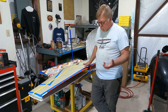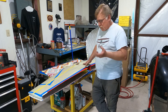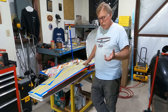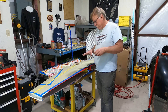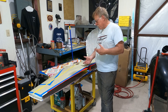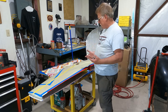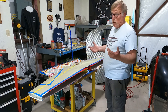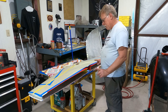If you only had one cracked spar, you're kind of screwed - you're going to have to take out the whole assembly and replace a spar. But in for a penny, in for a pound. If your spar is in perfect shape, just do that repair. But this aircraft has been ringing around with fatigue - it's obviously got some fatigue issues with the cracking going on. So we're putting two brand new spars in. The owner will feel a whole lot better when he's doing all those wonderful aerobatic maneuvers.